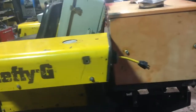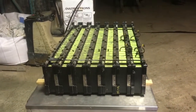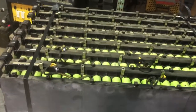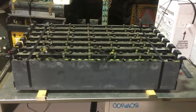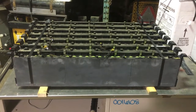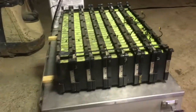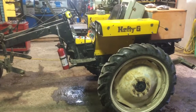Looking pretty good. It's almost time for painting, but it's not quite warm enough yet. I've also got to start assembling the battery pack. Here is one of the stacks — this will be the bottom layer. I'm assembling them and getting ready to wire them up in parallel and bind them together with strapping, making two layers, with an intermediate shelf in the middle of the battery box to keep them separate. I'm working towards battery assembly, then a whole lot of wiring, troubleshooting, and programming the controller — hopefully driving this thing around in about a month.